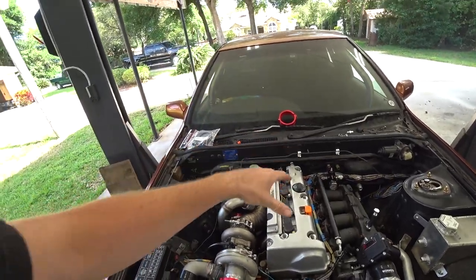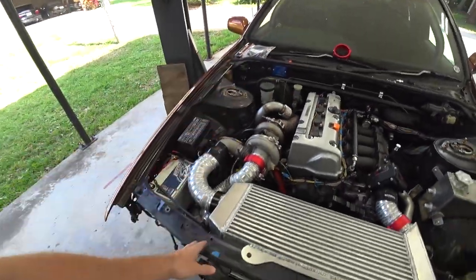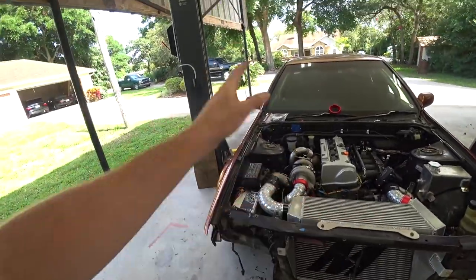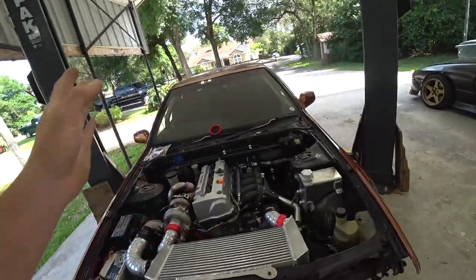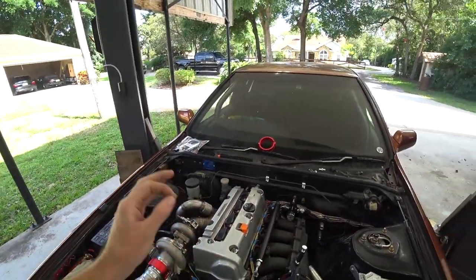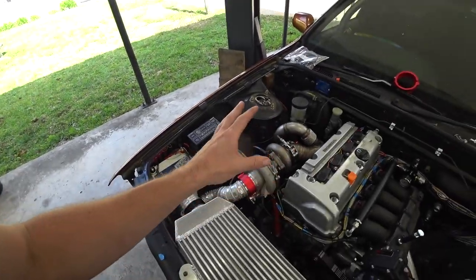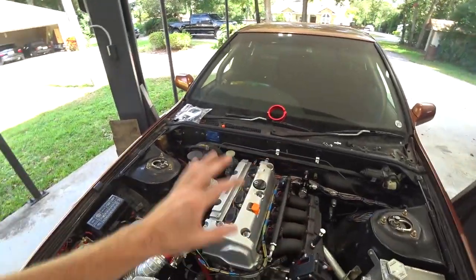We've also got a BMW ZF Trans, and we did a ton of custom fab work, you know, custom exhaust, V-mount, intercooler setup, intercooler piping, intake, expansion tank, etc. We put a standalone Haltech ECU in it, got it all wired up, got it running. The only thing stopping us from driving it is we're just missing some lines and fittings that we have on order to finish up the oil lines and the coolant lines. Once that's done, we can drive it.